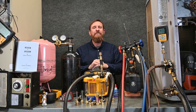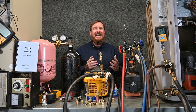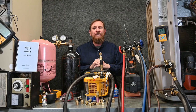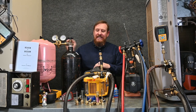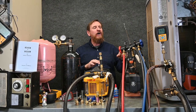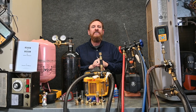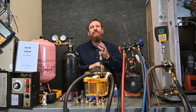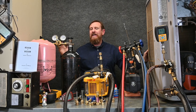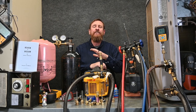If you don't pull that vacuum right, you end up with moisture inside that system, and that moisture turns to acid — even with mineral oil. Now we have polyester oil, and polyester oil used to be an acid; we dehydrated that acid to make it an oil. So as we get moisture back into that oil, it turns back into an acid, and that acid starts eating holes in the evaporator, eating holes in refrigerant line sets, eating holes in the condensing coil. All the copper that it ate away ends up copper plating inside the compressor, doing damage to the compressor. It also starts eating away the windings inside that compressor and doing damage to TXVs and all components of the refrigeration system.